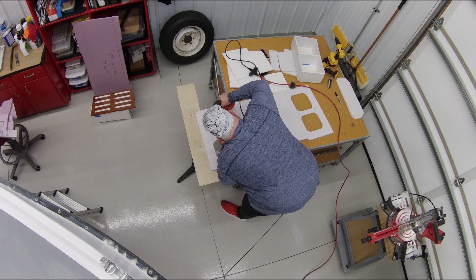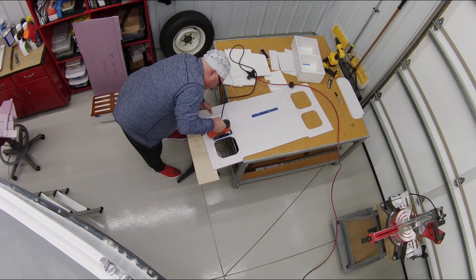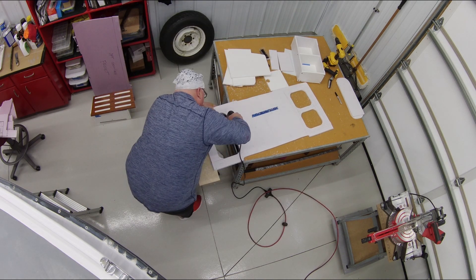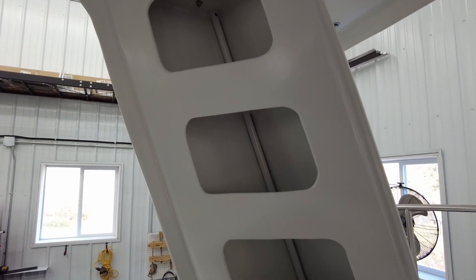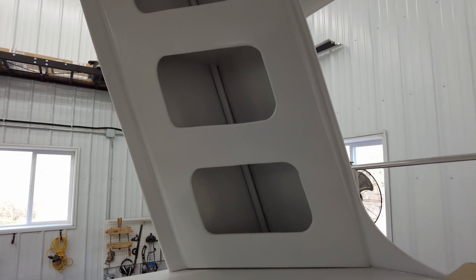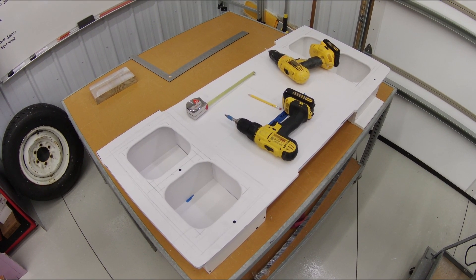What I'm going to be doing is cutting four holes in the front of the cowling. I'll be creating a box like a drawer that goes on the backside, and these cutouts will be very similar to what we've got up here on the pilot house — cubby holes that you can stuff things inside. It's very similar to what I used in the V-berth for the forward shelves and cockpit shelves, and we're doing the same thing in the aft cabin. I love cubby holes. With the cubby holes cut out and everything rounded over looking good, it's time to start assembling the pieces.